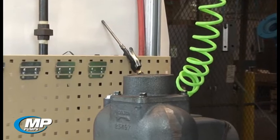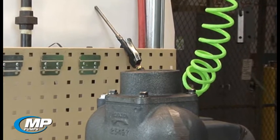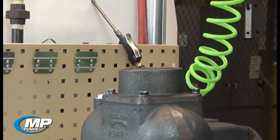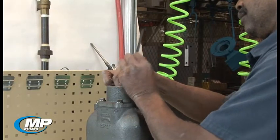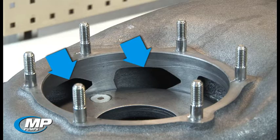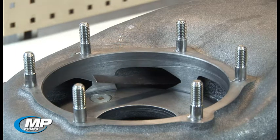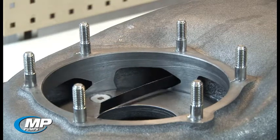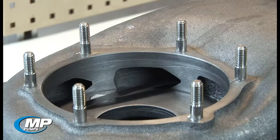If the shim stock was removed prematurely, it can be reinstalled using the following procedure to ensure the correct impeller clearance is maintained during the installation of the pump pack. Looking into the discharge port of the Flomax pump, you will see three holes in the housing. The one to the far right will be a small round cast hole, and the other two are finished machined rectangular slots. The middle hole or slot is where the shim material should be positioned. While pulling the drive sleeve towards the motor, insert the shim stock down the discharge port and through the middle hole in the housing, and position it between the impeller and the wear plate.